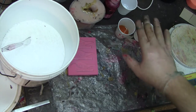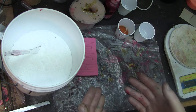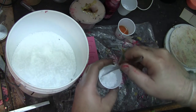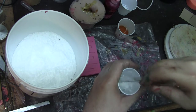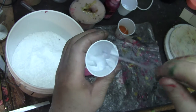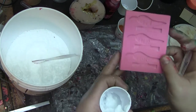So I have 20 grams of A and 20 grams of B. I'm going to mix them together after I put some Polyfiber 2 into Part B to make it a little bit thicker. Once the mix is together it's going to get thinner — remember this is half of the liquid amount. SmoothCast 321 has a 7-minute working time, so this will allow me enough time to separate these into two sections to get a little bit of green and a little bit of red.